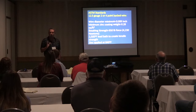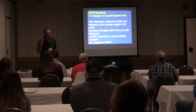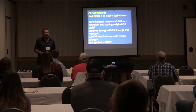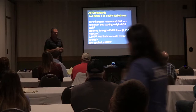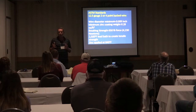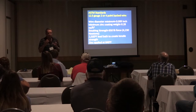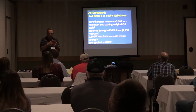That's what we see within that. Wire diameter — the wire without the zinc on it — is 0.099 inch diameter wire. They twist it together; a barb gets on one of the strands and then they twist the two barbed wires together. There is a minimum on the amount of zinc coating that goes on the wire. When we talk about zinc on the coating, does everybody understand why the zinc is there? Zinc is a rust inhibitor. Rust is oxidation, so the oxygen in the atmosphere is attacking the metal.